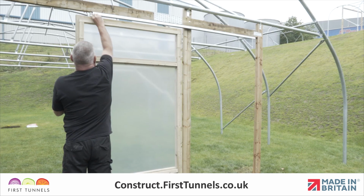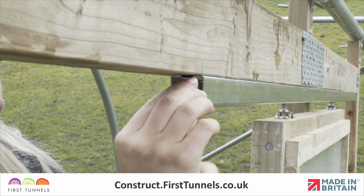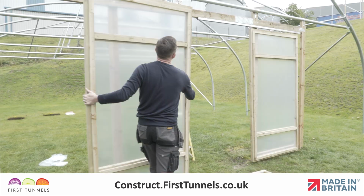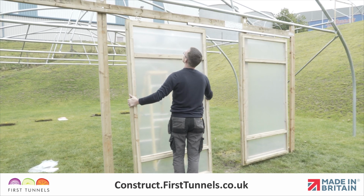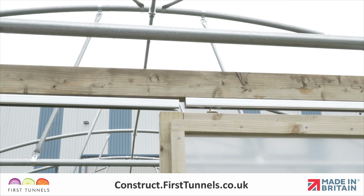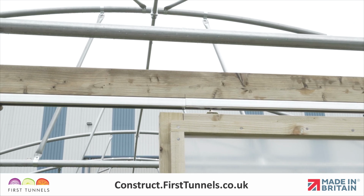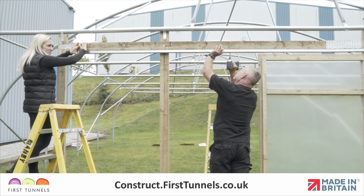Slide 1 door stop down the track, then slide 1 door onto the track, followed by 2 more door stops, the second door and then the final door stop. We will reposition the door stops once we have fitted the second piece of sliding door track. Butt the second piece of sliding door track up to the previously fitted piece and fix in position using the supplied screws.